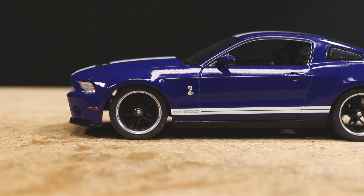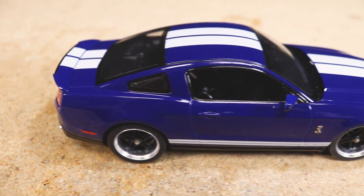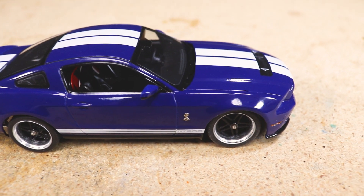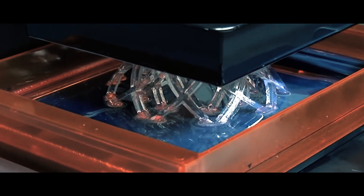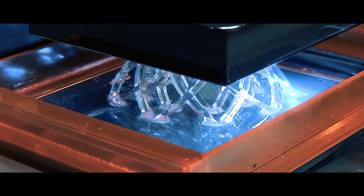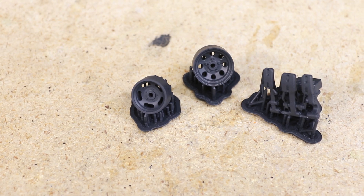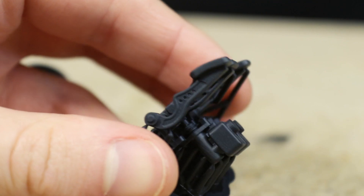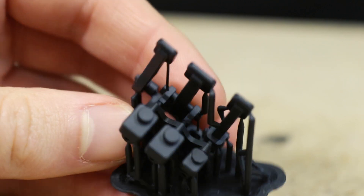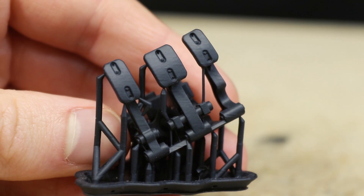I think I accomplished that well, but now I want to have a little more fun and design a couple of wheels with more detail, not limiting myself to creating something that's as easy to print as possible. I'll be using an SLA 3D printer to make these wheels. Rather than melting plastic, an SLA printer uses a laser to cure liquid resin. The final part will have a lot more detail and a smoother surface. For smaller detailed parts like this, the SLA printer is king — but print time will be longer and generally both the printer and resin are more expensive.